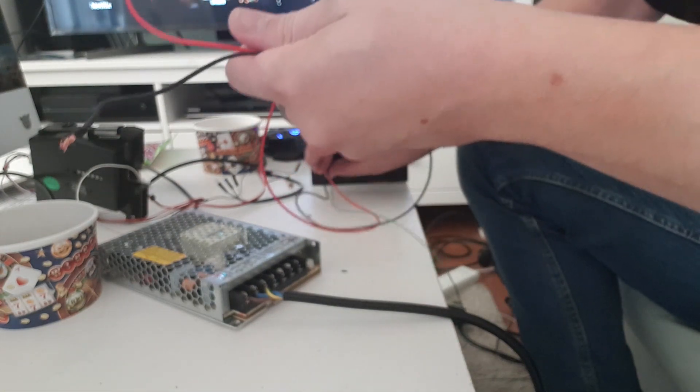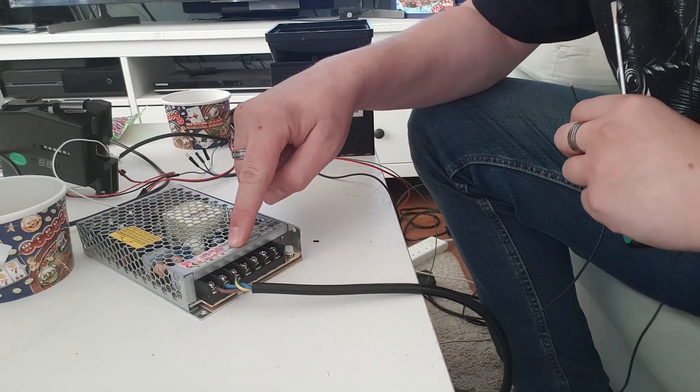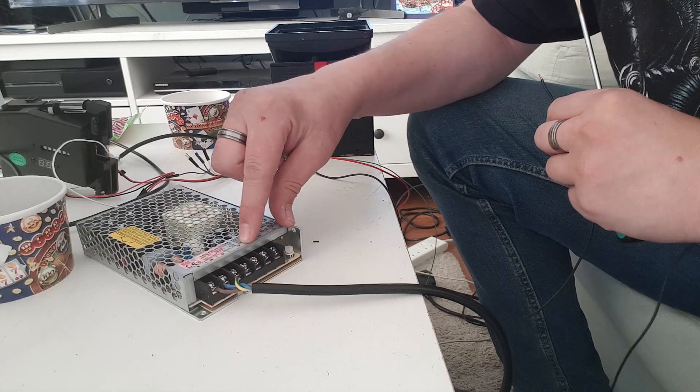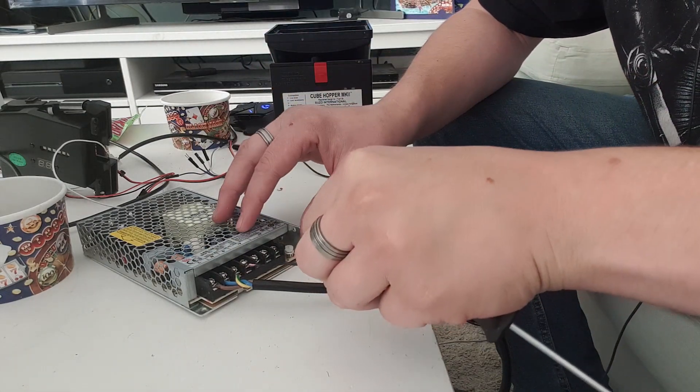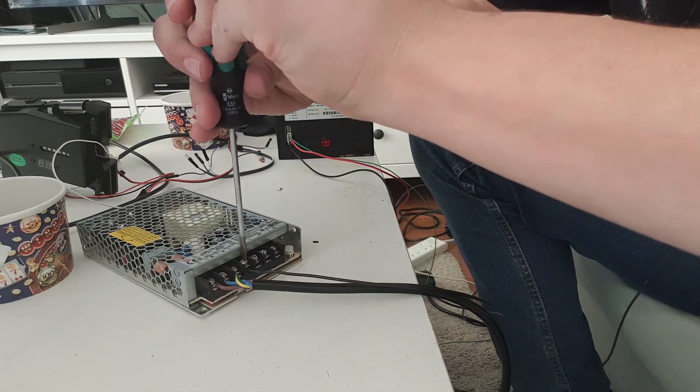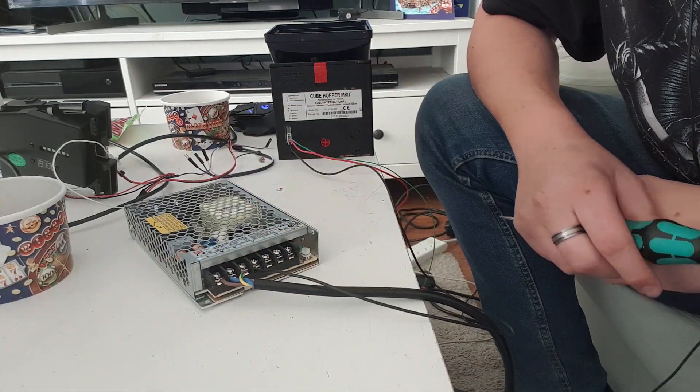Making sure the ground is in the bottom pin — ground is pin nine. We're going to lose the green wire for now and just deal with the red and the black. Hooking up a relay can be a little daunting but the first thing we want to do is hook our black wire into the power supply. Make sure you install it into the negative voltage or anything that says GND. Undo the screw on the fourth nodule and place the ground wire underneath, then screw it back up.